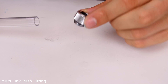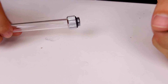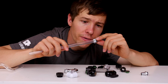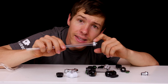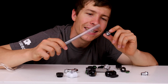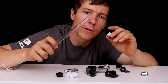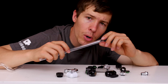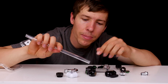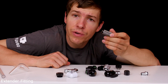There is one other variant for rigid tubing: push-in fittings, where you simply push the tube in and that's it. What holds it in place is the seal between two rubber O-rings on the inside and the tube itself. While not quite as secure as a compression fitting, it still works. One thing to be mindful of is that sharp tube ends can cut the O-rings on the inside as you insert them. A great solution is to purchase a deburring kit or simply use sandpaper to smooth out those edges.